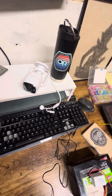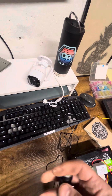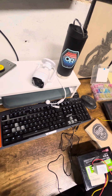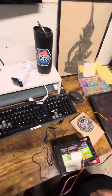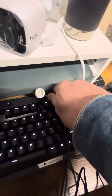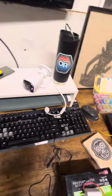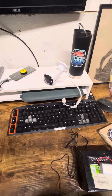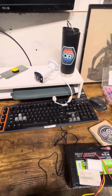I did try using some car lighter adapters — I think those are 6.5 volts — and they would power on the camera but wouldn't fully power it on; it would flash red and green but wouldn't show the Wi-Fi signal from the camera that you need to set it up. So I invested in this converter, it's less than $10 on Amazon, and it's working great. I plugged it in with the battery fully charged, got the red and green light, and it showed the signal and set up perfectly. I'm gonna go drop this in the forest and see how we do!